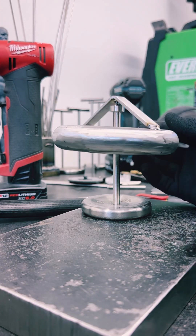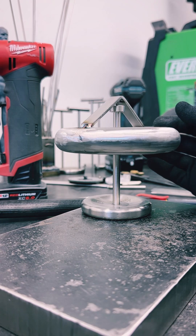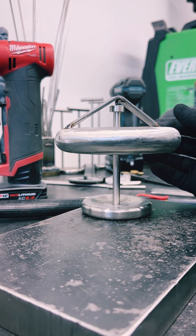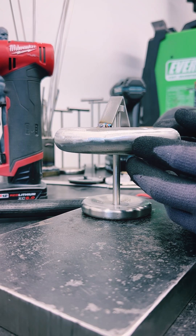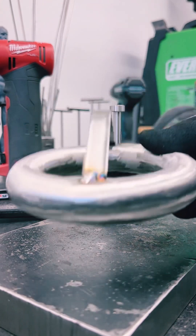It's important you do it right at this stage. Once that pin and little bend are balancing perfectly, you can roughly attach it to the ring. This section is very crucial. You tack weld it to the ring and I turn it 90 degrees at a time, making sure that it doesn't lean one way or the other. If it does, I can break off the welds and put it into a different position so that it balances perfectly.